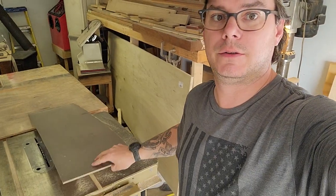So I've got my finishing material here ready to finish the face of basically my cabinets. But before I do that, I want to go ahead and mark the insulation for the inside of those spaces. So what I'm gonna do is I'm going to put the panels up there, trace it from the inside, and then cut my insulation and pop the finishing panels on the front so that I can just pop the insulation on through the inside, or whichever order I do that in. I don't want to finish the face of these first, because then cutting the insulation will be a matter of taking measurements versus just tracing an opening. So I'm gonna go ahead and I'll show you what I'm talking about.